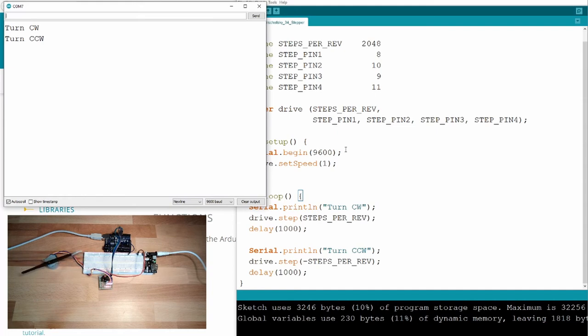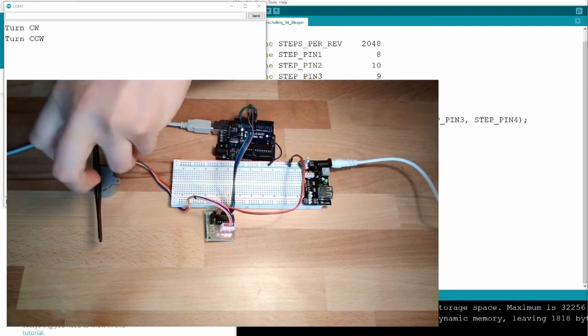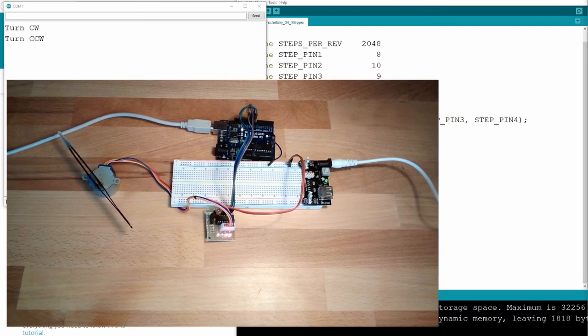One thing, the stepper motors. If we are losing steps, that's the big disadvantage of stepper motors. If the rotor cannot follow, either it's blocked or not, we're not noticing it. Then it's just wrong. It maybe has lost a step, and it does not really count. It will simply move with the next step. So if we lose one, then we make one too less.